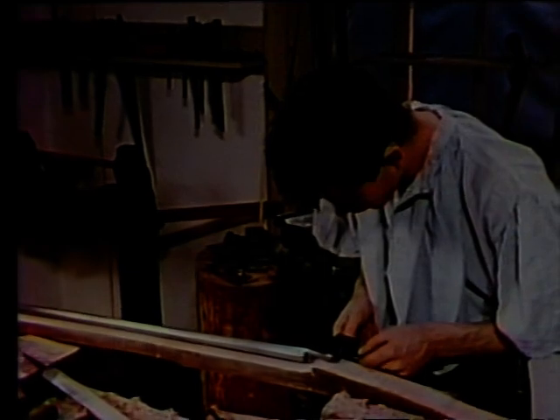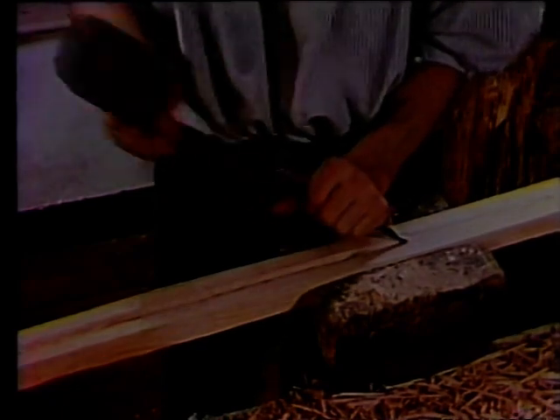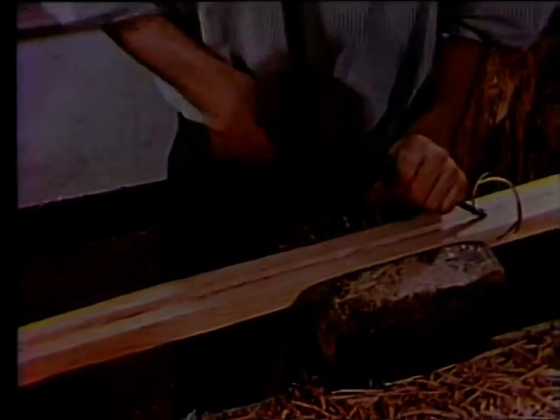The process began with bedding the barrel. The many other elements of the gun were proportioned and positioned in relation to it. First the center line is scribed on the stock. Then the breech plug is inlet at the back of the stock. This keeps the barrel from turning as it is being inlet. After the rough outline of the barrel has been scribed, the channel is roughed out with round gouges.